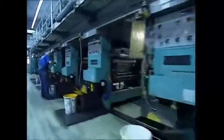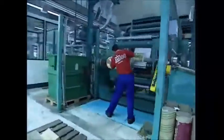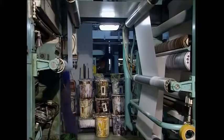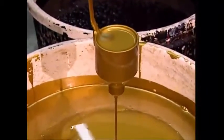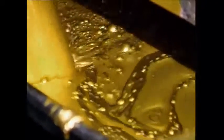The next stage of the job is to start printing. This 30-metre-long printing press will turn one enormous roll of recycled paper into hundreds of metres of Christmas wrapping paper. The paper used is the same as they would use to print magazines or even your daily newspaper. A quick quality control check is made before the print run starts. Gold will form the background colour for this print, so it's applied first — bucket after bucket is added to the feeder vat, which sends the paint up to be used on the first roller.